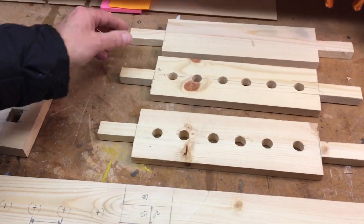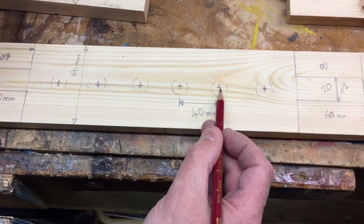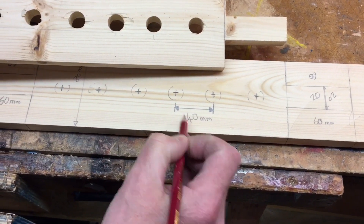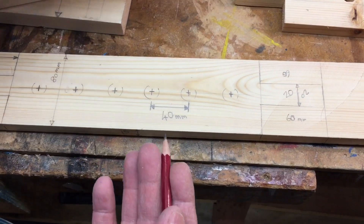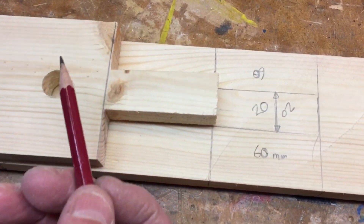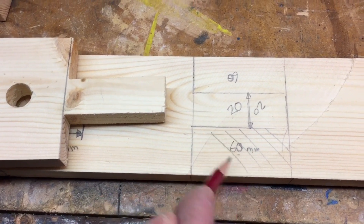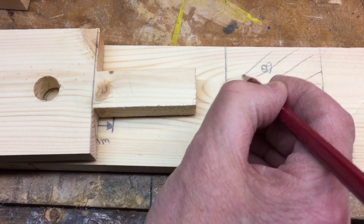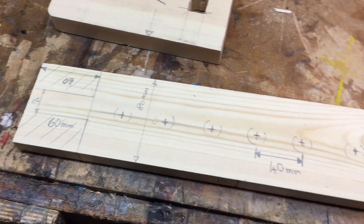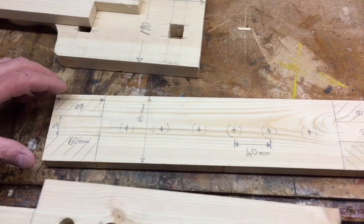Before we move on I just wanted to show how we make these back connections — it's 80mm wide. Each hole is 40mm from centre to centre, and you can change that for your own design. This type of joint can be seen as a mortise and tenon — the tenon is roughly 20mm and it's 60mm long. This is the bit we're going to cut off — the same here — so in effect you'll have four cut-off pieces, and it will look something like that when cut.